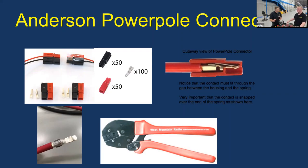Very important: make sure you get that crimped all the way down and you hear a snap when you push them together. If you don't, it could pull out or vibrate loose. More importantly it could melt — we've seen connectors at competitions vibrate and get so hot they actually melted because they weren't crimped properly. We had to cut them all off a rookie team's robot several years ago.